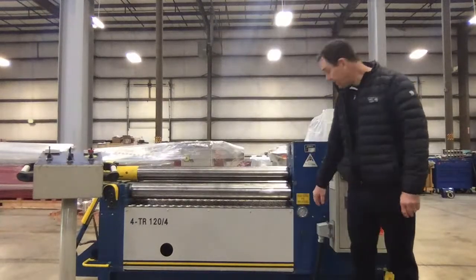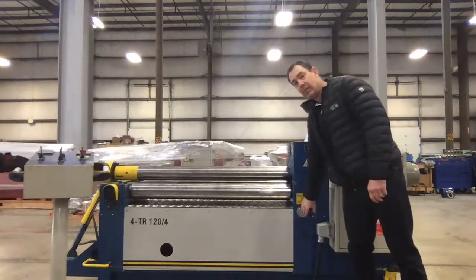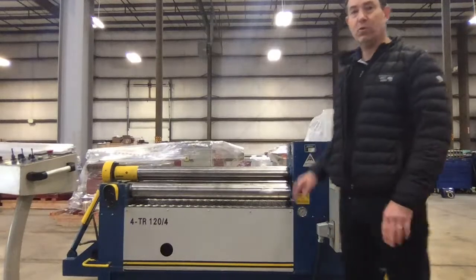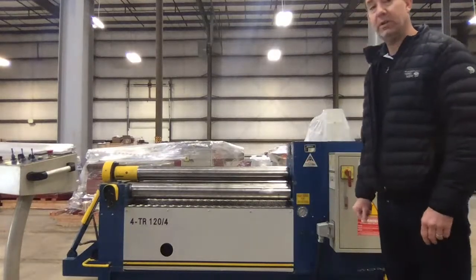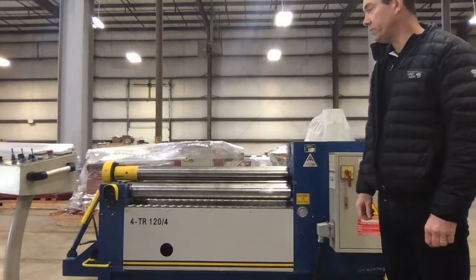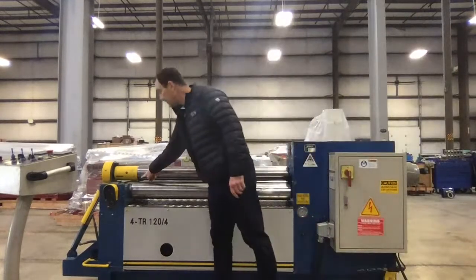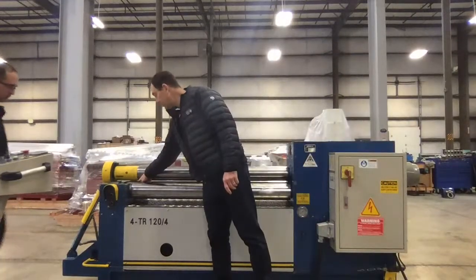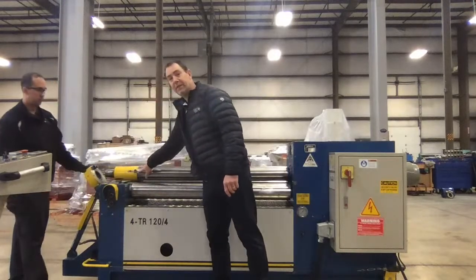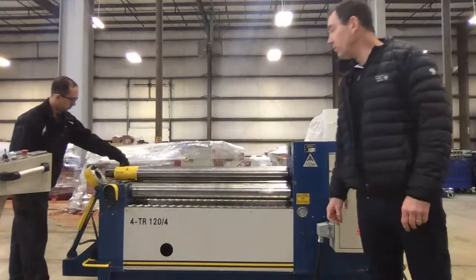The pinch device on this particular machine has a manually set hydraulic pinch pressure, which is a little different than the three-roll machine, but gives you a little more range of adjustability since the top and bottom roll are directly over one another when the material is being pinched. The cone bending attachment on the four-roll machine is the little hardened shoe directly on the bottom of the top roll — this is the surface that the minor end of the cone will drag on to facilitate cone bending.